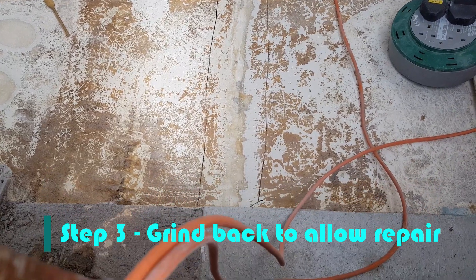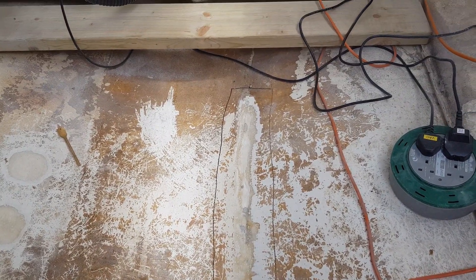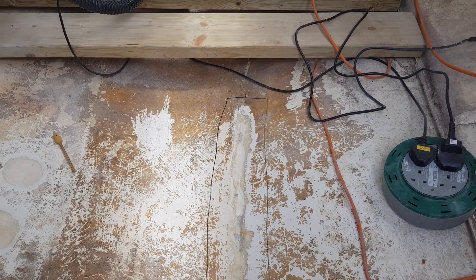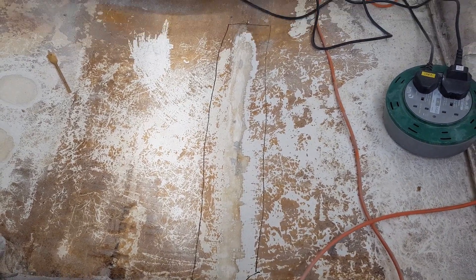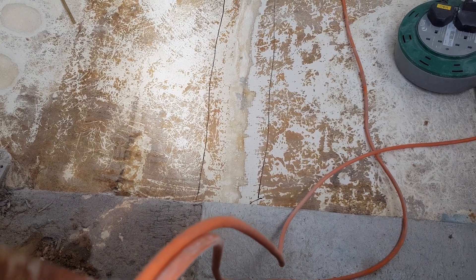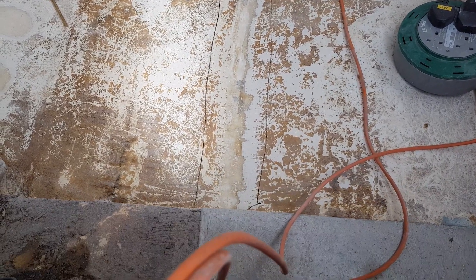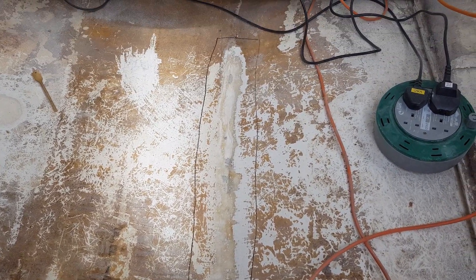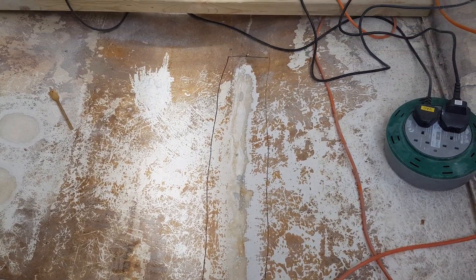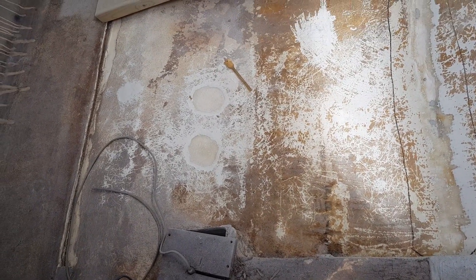So here's where we're grinding today. I'm going to take it back, bevel it to the edge of the black outline that I've just roughly drawn in, and lay some glass up — make it nice and smooth and flat and strong. I reckon I want to put three, four, five layers in to fill the void, and then a nice big patch across, and then start on the other side and fill those two blisters in.